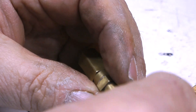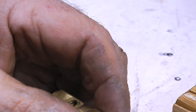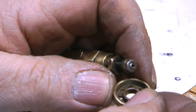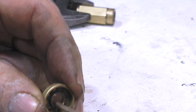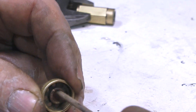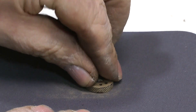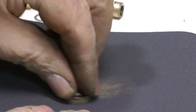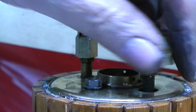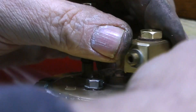This clip shows the problem: the main hand wheel has broken off the hand wheel boss — it was machined quite close to the edge, and someone has had a go at fixing it using car body filler, which doesn't work. All I did was clean up the inside surface of the hand wheel and then silver soldered a 5BA nut into the center of it. After that I cleaned up the hand wheel on wet-and-dry sandpaper, gave it a quick polish, and refitted everything.